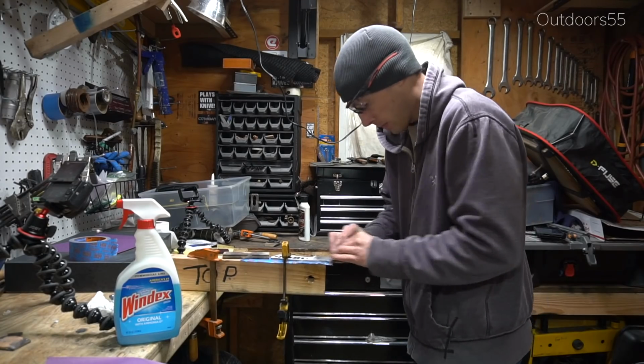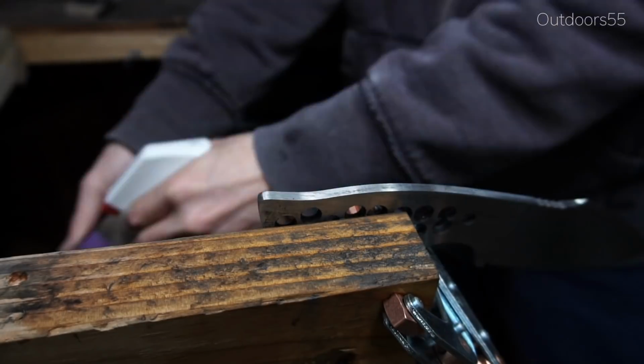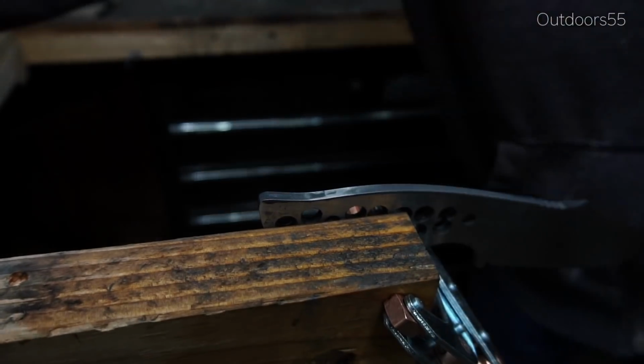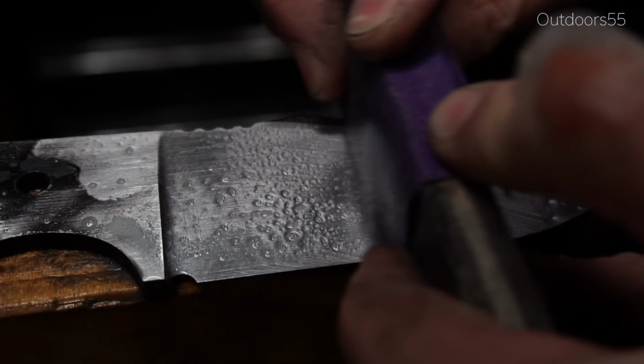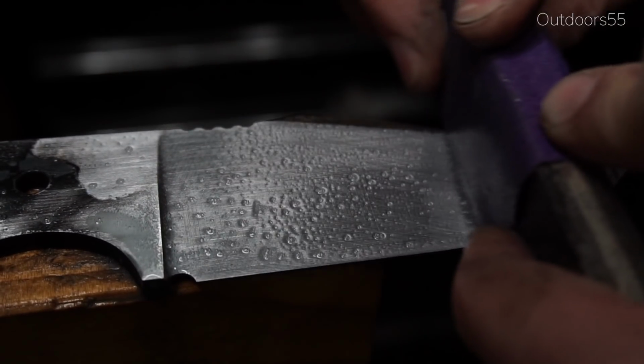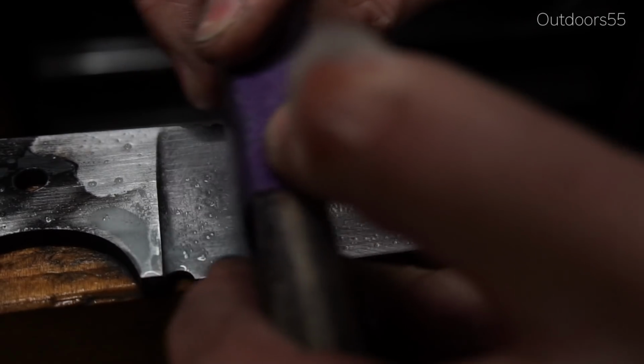After the tempering, it was back out to hand sanding. Now, this is the time consuming part because you're sanding hardened steel with 150 grit scratches in it all the way to 2000 grit. This takes a long time. This is going to take a solid afternoon of sanding. At least it took me a solid afternoon of sanding to get this blade to 2000 grit.